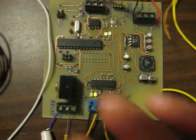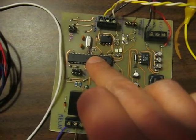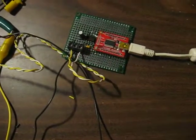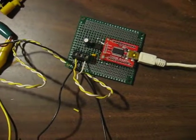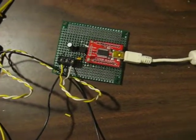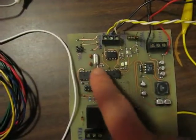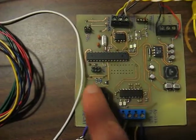there is a delay. So the fact that there is an ID comes back in through this RS-232 chip and into this Arduino, who in turn once again relays it back out through this RS-485 chip and into the server interface. Now the server interface gets the actual ID number, cross-references it to a database to find out which user it is and whether or not that user is authorized to enter the building. At that point it responds with access granted or access denied, and it sends that packet back down the RS-485 again into the Arduino. And at this point this particular Arduino makes a decision whether